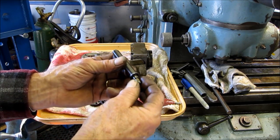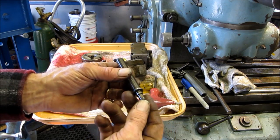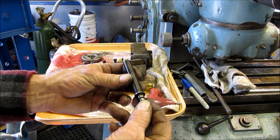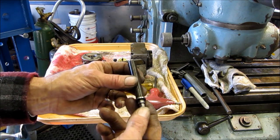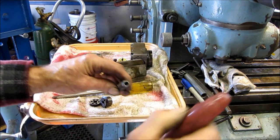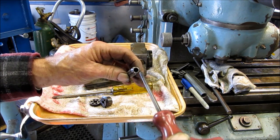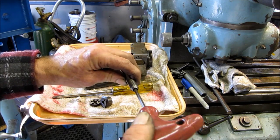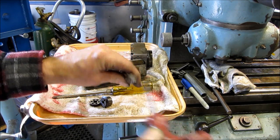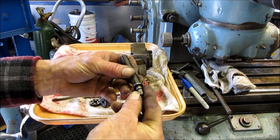How about super glue? I don't know. She's hardened. We're going to go hunt up either a piece of tool steel or a piece of 8620. If we got tool steel, we're going to use tool steel. Now, you're asking, hey, how are we going to get that in there? We could modify this to actually have a grade 8 socket head attached to the end so that we can have this control. Everything else is pretty well just straightforward. It is tiny, but we can do it.